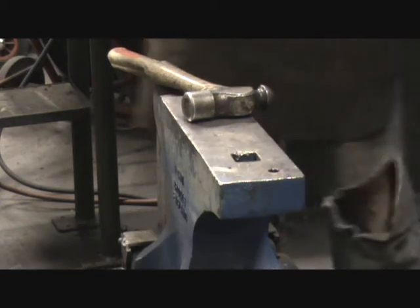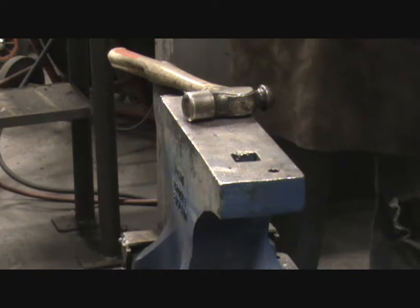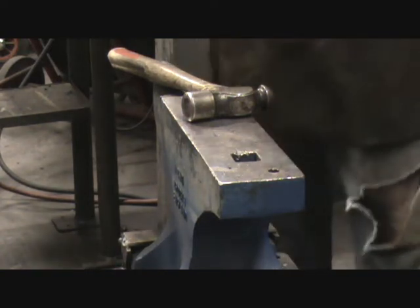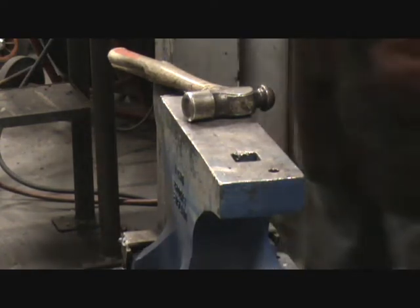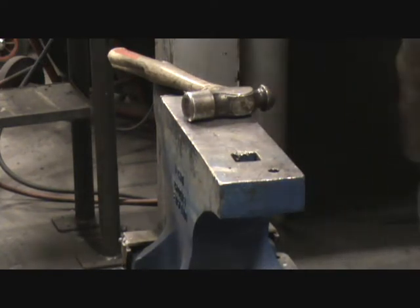So we've got a pre-drilled hole in the top of here. You're going through one first of all, the metal rivet through one, because actually getting two holes lined up on your copper and your metal is almost impossible to do. I've cut the rivets down too, so you've only got one and a half times the diameter sticking out the other side.